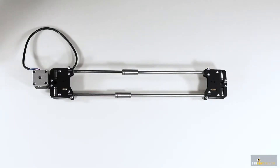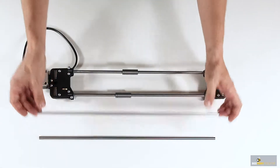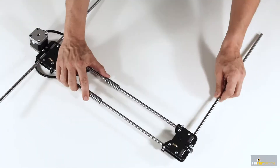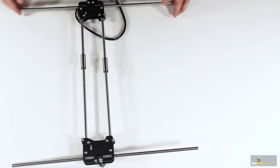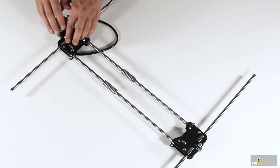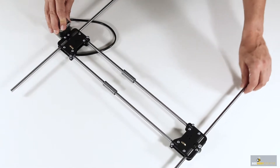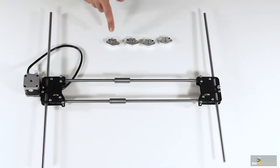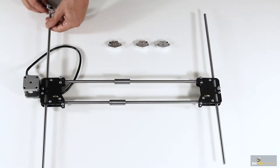In this video we'll be showing how to mount the x-axis onto the B2X300's main metal frame. We start by slotting the final pair of linear guides into the linear bearings on each side. The bolts on the ends of the x-axis were left untightened in the previous video so it's easier for the guides to slide through without difficulty. Note that we won't be tightening them yet.